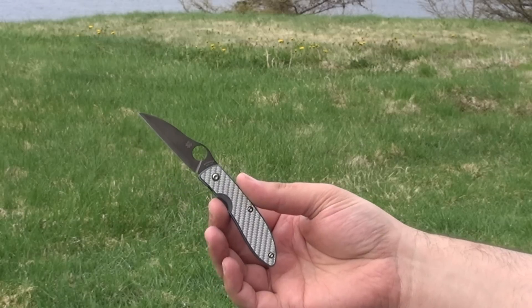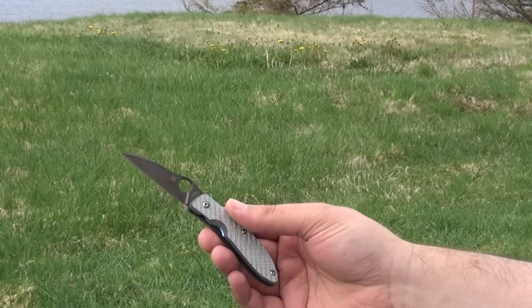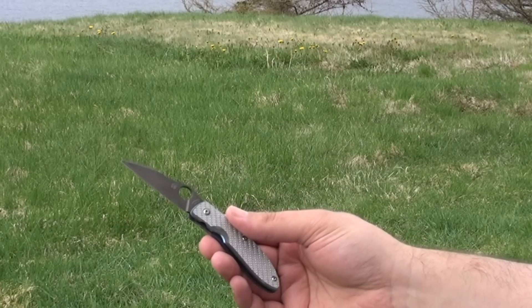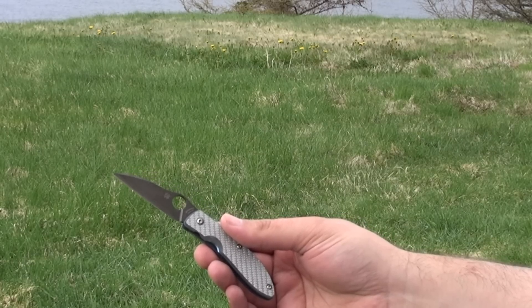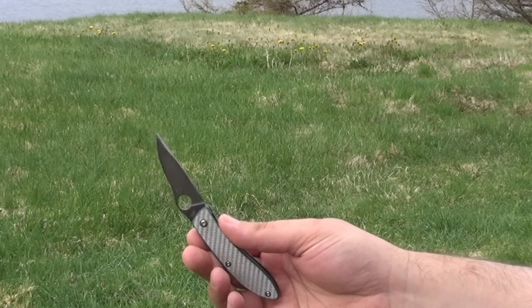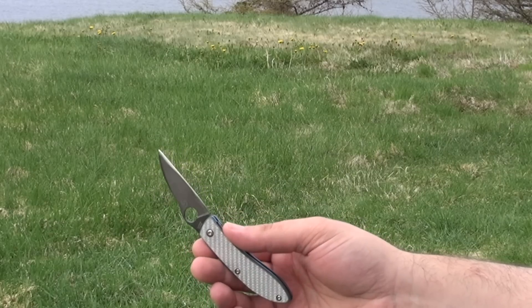This week's challenge is a bit different. Your friend drops off this blade to you — he's very intrigued about the steel. He's done a bit of research: it's a high speed steel, basically M2 with a modification to increase the vanadium and carbon content, which dramatically increases the wear resistance and obtainable hardness. Because it's a high speed steel, the carbide aggregate is going to be smaller than in the high carbide stainless steels like ATS-34 or VG10.